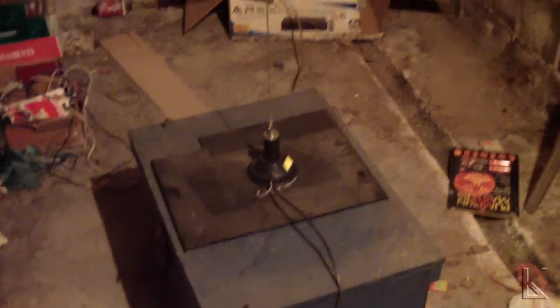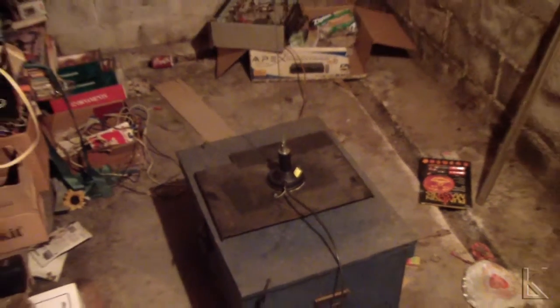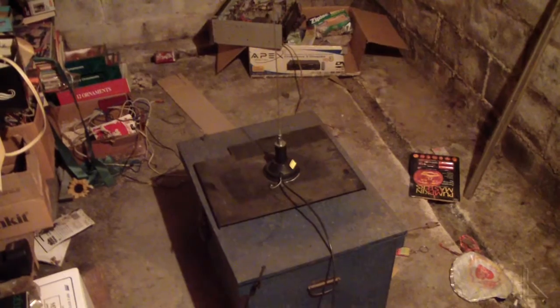There's your quick tip for today. If you're going to use a mag-mount antenna inside, put it on a metal plate — and you don't actually have to have an electrical connection to the plate for it to be effective. Confirmed. Thanks for watching.